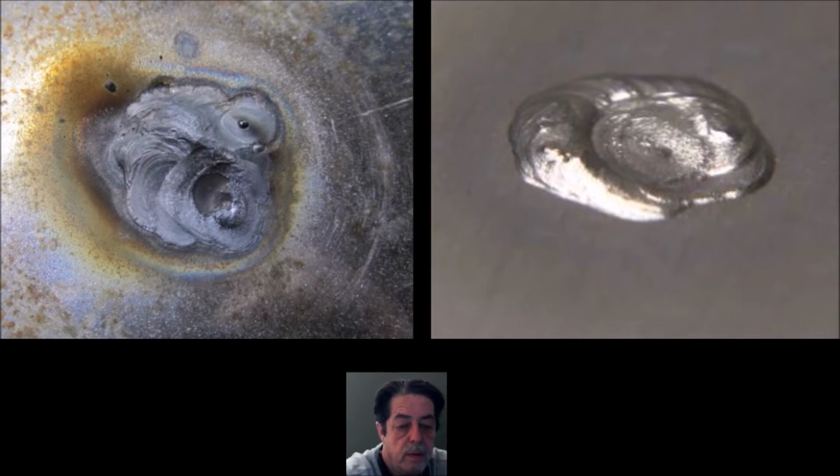I have better luck with the way that I do it. I don't say let it cool for a long period of time. I hit it, I wait a few seconds, the metal starts to cool down, and then I'm over on the left and I do it again. I let it cool down a little bit, then I go to the top, the bottom, then I start going in between and bounce around until I create what you see in one of these pictures.